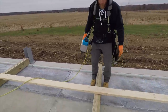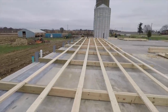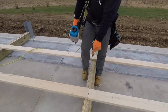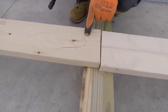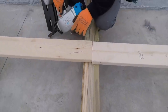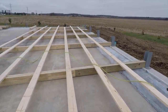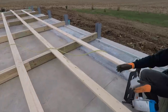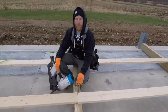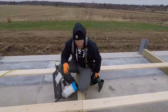So what that means is we'll get all of our stuff laid out like you see. And then we go through and we put an S on the joints where we have our splice. And so what we got is that is our 5th post right there. So anything that is attached to that post that way, we nail. Everything that is attached to this post in that way, we nail. And the posts or the boards that splice, we put an S and we just pound a 20 penny nail.